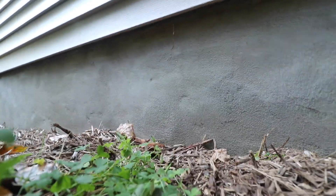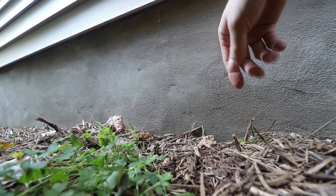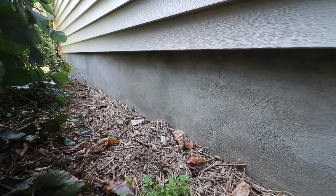You can see some of the imperfections — like that's a fairly noticeable small dimple right there — but it's got that human touch, that handmade touch. It's not perfect, but this section came out really nice. I'm really proud with how this section came out. If you want to unify the color a little bit more, something you could do is wet this and paint it with Portland to make the color a little bit more unified. But in my opinion, this looks really good and it's holding up extremely well, as I expected, after one year.